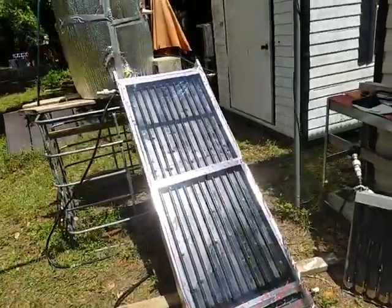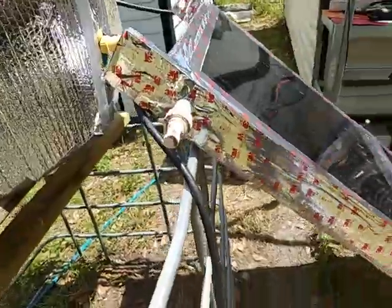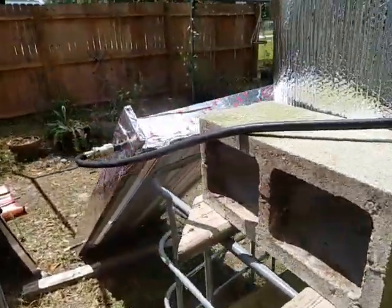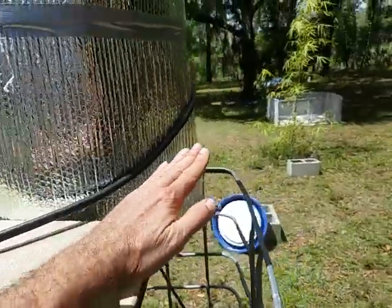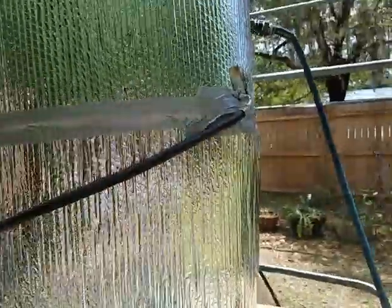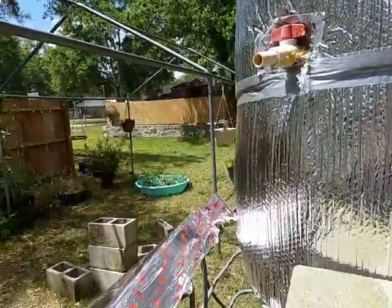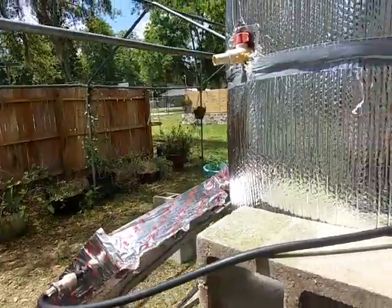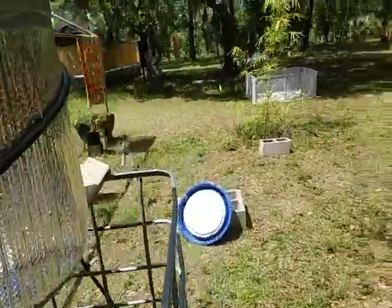Right now we're using laundry hoses for testing, and that creates problems because you always have to have your output pipe sloping up — if it has any down slopes the hot water will stall. We had to rotate the bucket because of the lengths they come in, but it is working. What we would do otherwise is just use some CPVC pipe and go directly in, and that's what we're going to end up doing once we've decided the location. It's always on a slope up, and the steeper the slope the better.